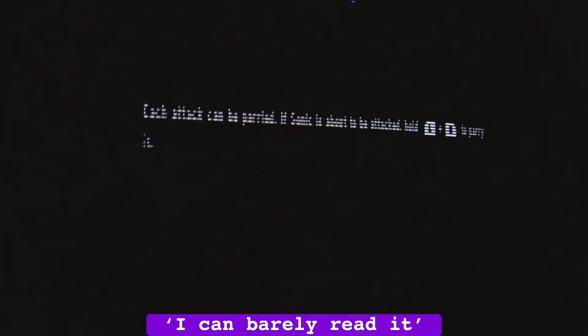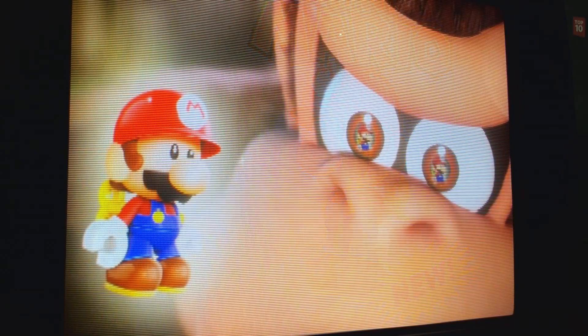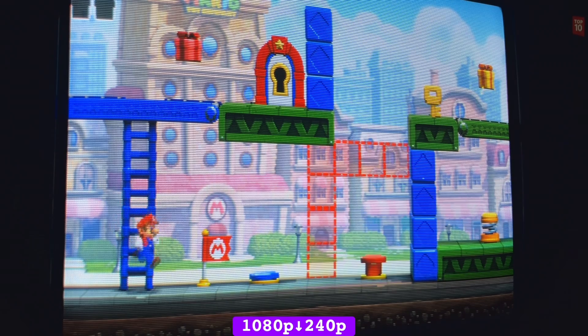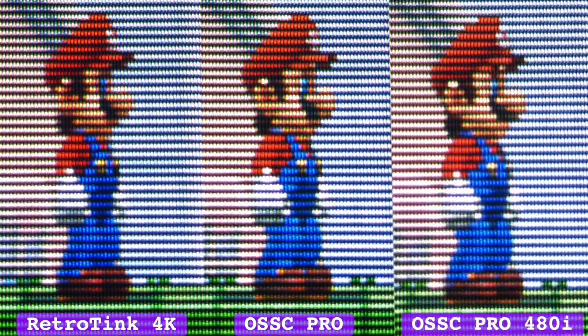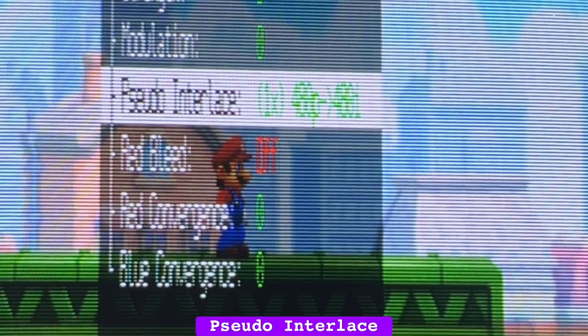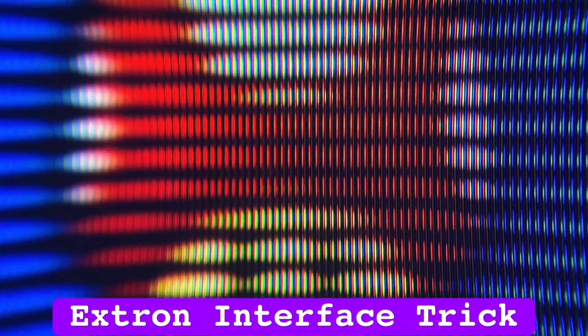Even my little ones agreed — you can barely read the text in those scenarios. 3D content decimated down to 240p also suffers a major hit in detail, and in these scenarios I've always recommended to output 480i where possible. The OSSC Pro's 480i output is the clear winner in preserving more vertical resolution. The RetroTink 4K's 240p output is otherwise equivalent to the OSSC Pro's. The Tink 4K has an interlaced simulation function, but the output is still progressive with a kind of bob flicker most apparent on static text and broader outlines of sprites — more like pseudo 240p from the unreliable Extron interface trick, but without the Vaseline filter.